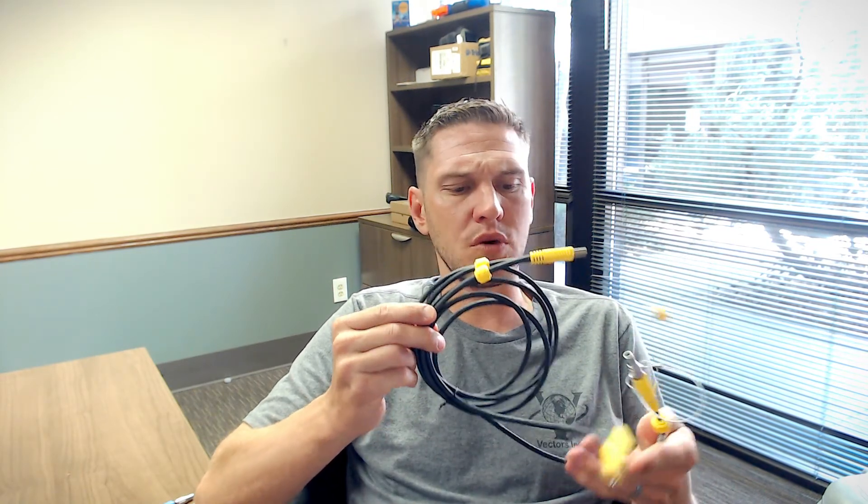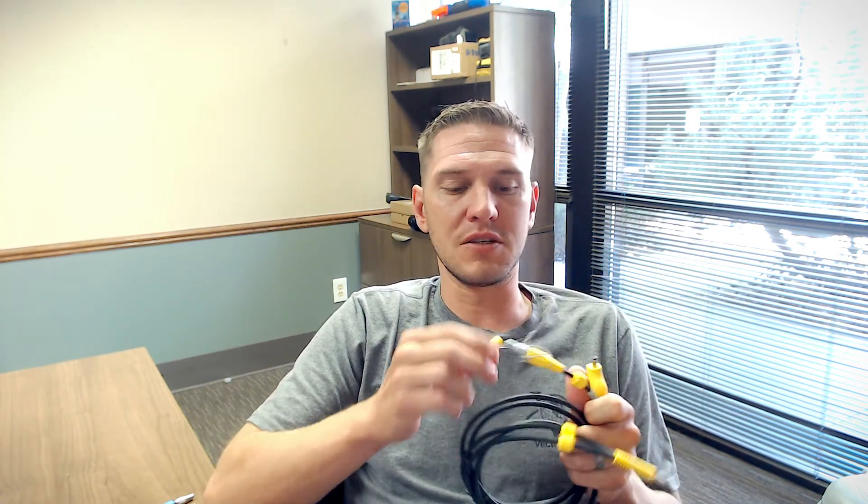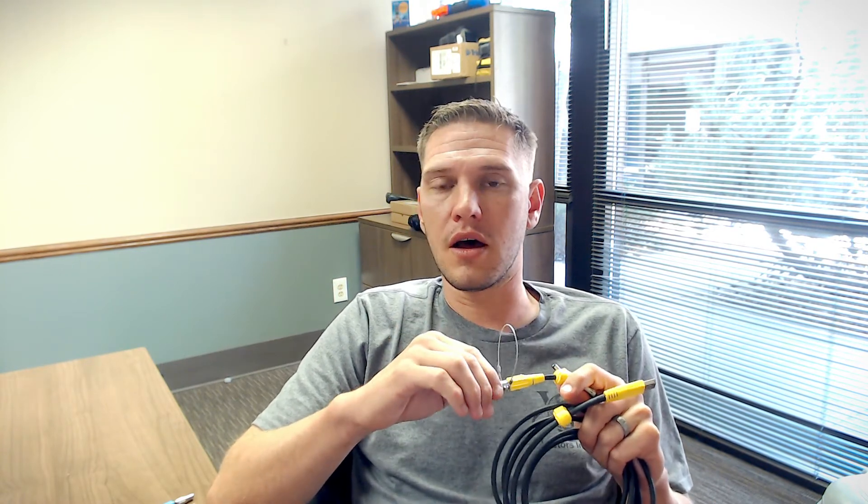The last one here would come with the R10, R10 Model 2, or R12S. There's a 7-pin LEMO connection as well. The only difference is there's another rib that lines up with the keyway in the receiver. The R10 has two ports on the bottom: a standard 7-pin LEMO connection on one side with a black ring around it, and then another port next to it with two keyways, which is used with this cable. This would be the download or program cable for R10s, R12s, R6s, and R8s - just a standard 7-pin LEMO to USB connection.